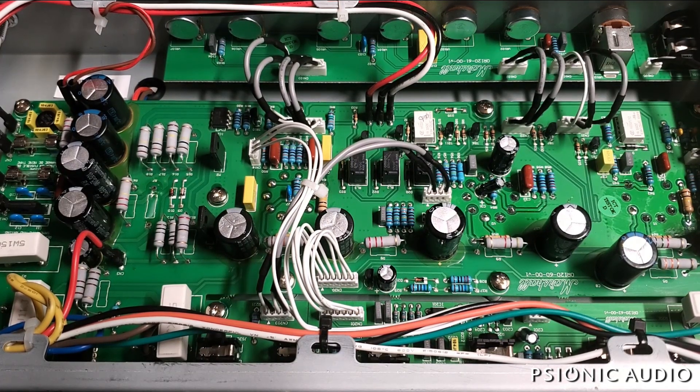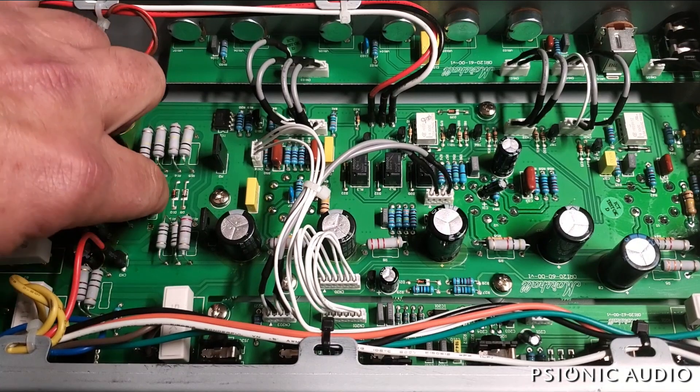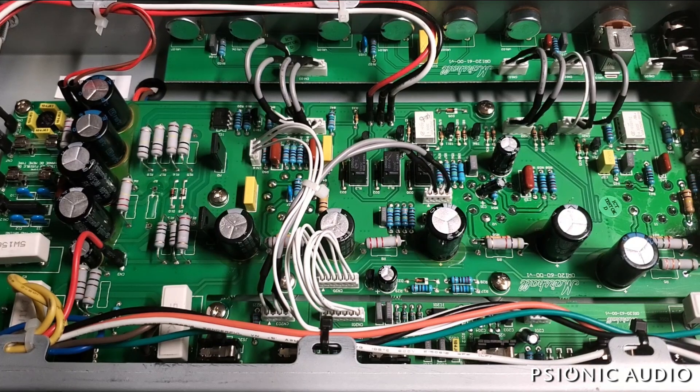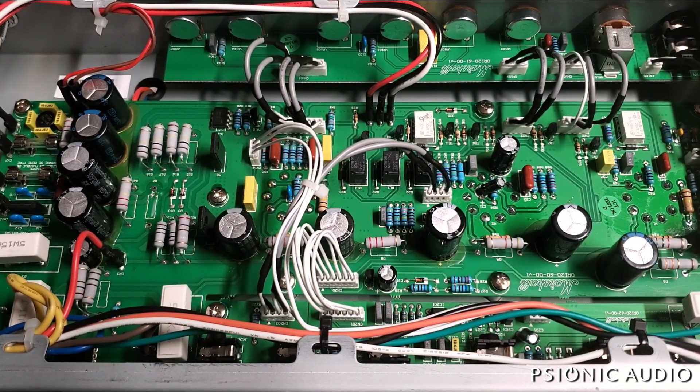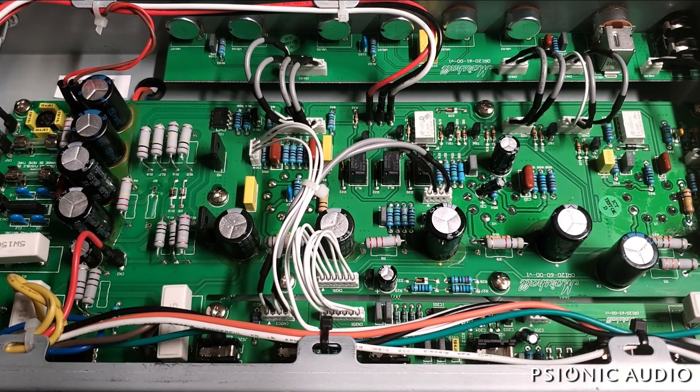The first video that came in on this amp — R7 here — is missing right now. R7 was dark and discolored. It's a 150-ohm resistor that serves in place of a choke in this circuit to simplify — maybe to oversimplify — but for our purposes, R7 takes the place of a choke. I put in a 200-ohm resistor, a 2-watt 200-ohm resistor, until the 2-watt 150-ohm resistor arrived.